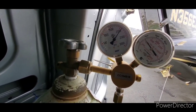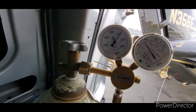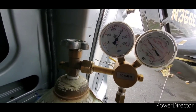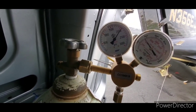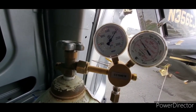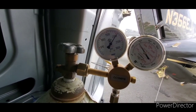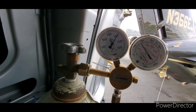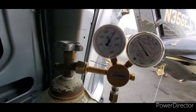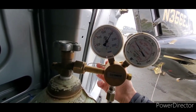The chart will tell you what to service to at a given temperature. I've seen as low as 1,625 at negative 32 degrees actually being full. So if you went to 1,850 at minus 32 degrees, that bottle has actually shrunk from temperature and pressure is lower. When everything expands back to 70 degrees, you've over-serviced the bottle and you're probably going to blow out the safety regulator.